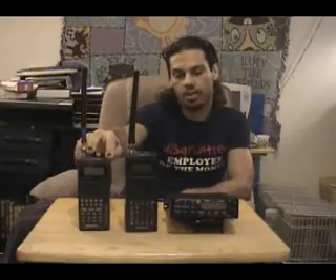There are certain frequencies that are deemed inadmissible for interception. For example, in the 830 megahertz frequency band there was old cell phone data for the AMPS system, where if you were to intercept and decode that data you could clone cell phones. So they've blocked out certain frequencies. This scanner sports itself as an 800 megahertz scanner to lure people trying to do cell phone cloning to buy it — however, those frequencies have been locked out. Certain frequencies like 310 megahertz are supposed to be security frequencies, so you're not allowed to intercept them.